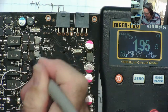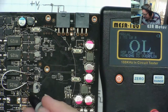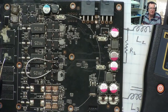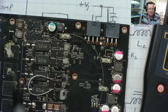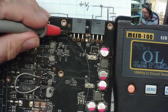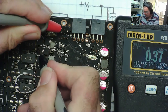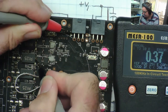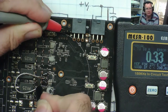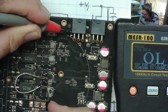Let's have a look across these coils first to see if they have any sort of resistance. I'm reading 1.28, so there's a little bit of resistance — probably about 0.1 ohm above the short baseline. The question is can we actually find the short? I'm not sure, because the GPU has very low resistance which might affect the readings, and there are lots of capacitors in the circuit that will conduct the 100 kHz from the ESR meter and may also affect readings. Let's have a go — we'll go from 12 volts to each coil in turn. That's reading 0.37.